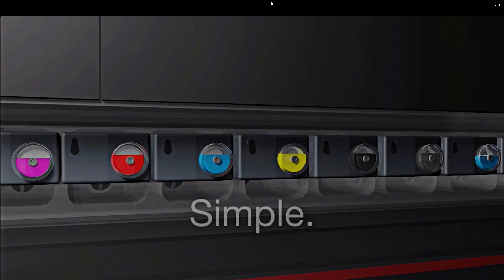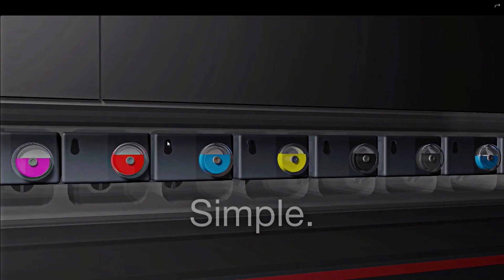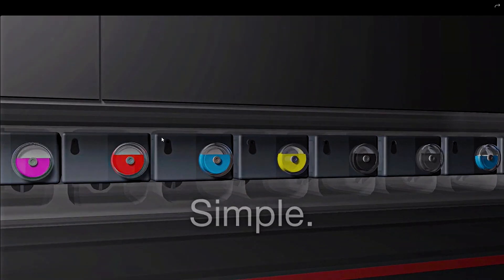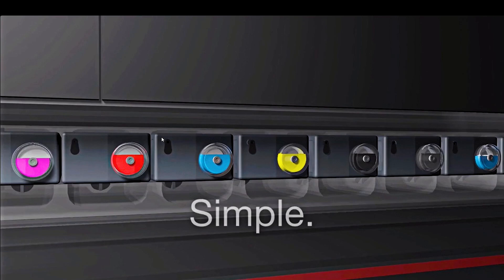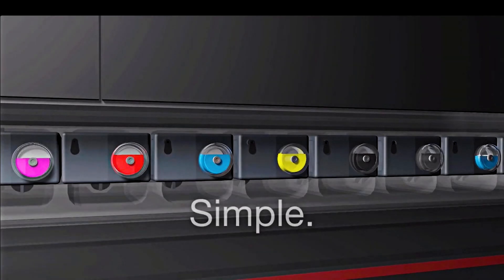As you saw demonstrated, the fill holes have been drilled a little too low from the top corner. I usually drill my holes right about at the top corner area, which gives the best possibility of the plug sealing, because the wall of the cartridge is at its thickest there. You drill a 5/32-inch hole carefully and install a plug after cleaning up any burrs from drilling that relatively gummy plastic.